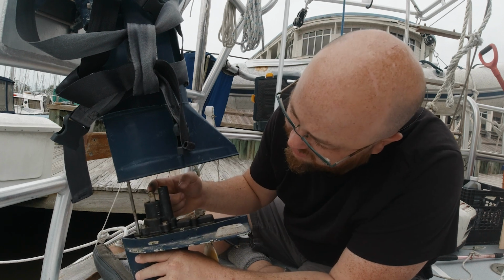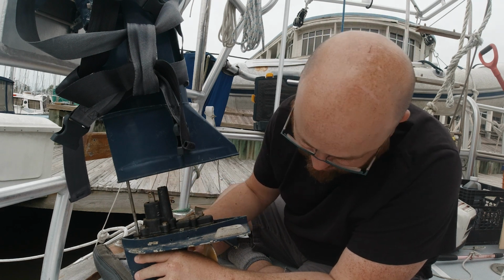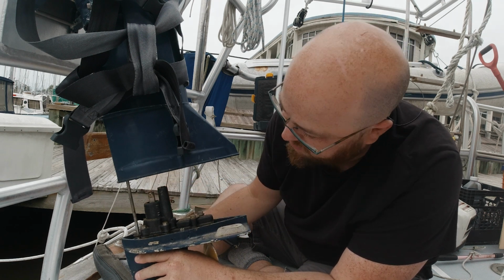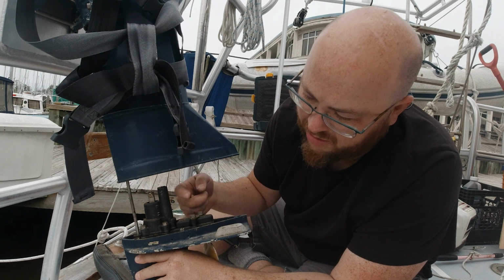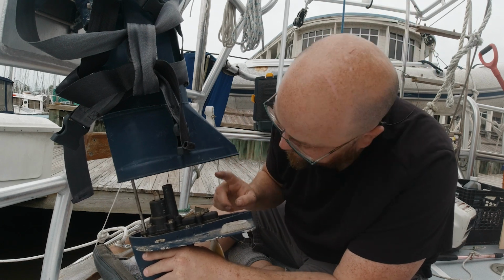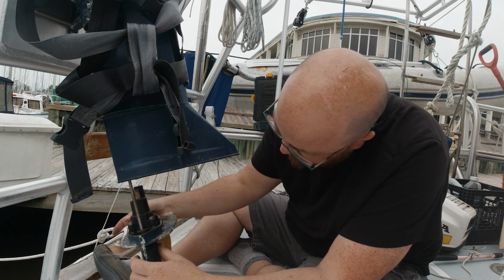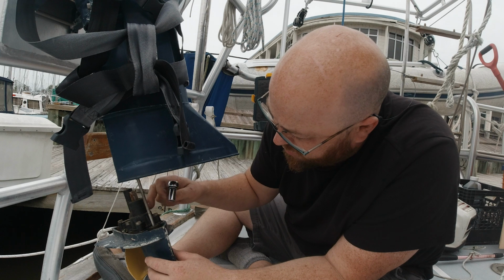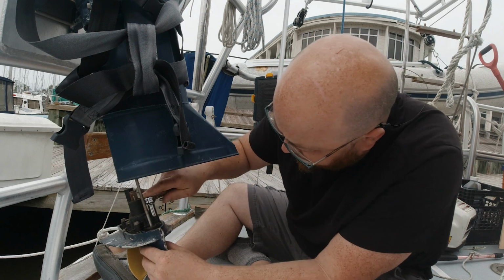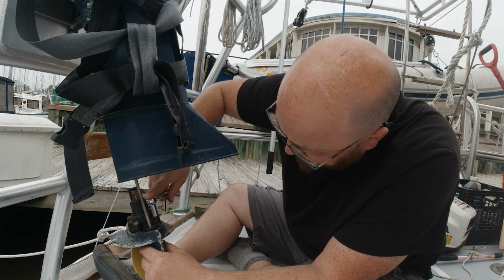This square one in the middle here is actually the drive shaft that drives the propeller and the gear down the bottom here. This tube right here is actually the raw water impeller out that is sending raw water up towards the cooling up top. So I'm going to gently set this here somewhere where we're not bending the shift linkage, and then these 4 bolts around this housing is what we got to take off next, and drop the socket driver, obviously.